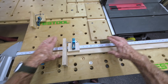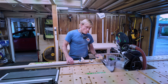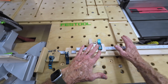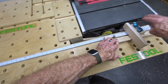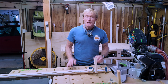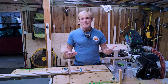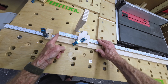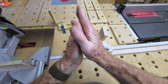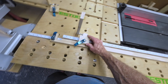This ProStop Xtend will make all of the cuts that the standard stop will make, so I don't lose anything on the short end. I started with wanting to use this one along with this one, but I realized that to have it on there ready to go, I was constantly having to move it or pull it completely off to get this for its full range and then switch over. So how does it work? I'm using a two tape measure system — one picks up where the other one drops off. I use the cursor in this cursor window to line up where I want my cut, exactly where the cursor on the standard stop goes. All I need to do to make sure this stop will cut where I want it is to line up this cursor with that cursor.